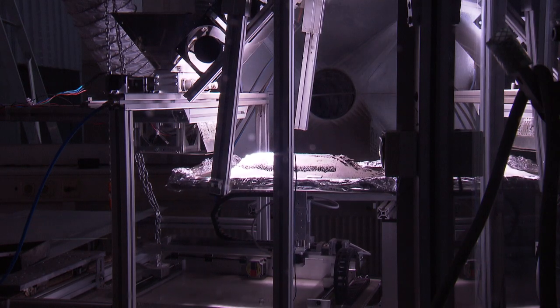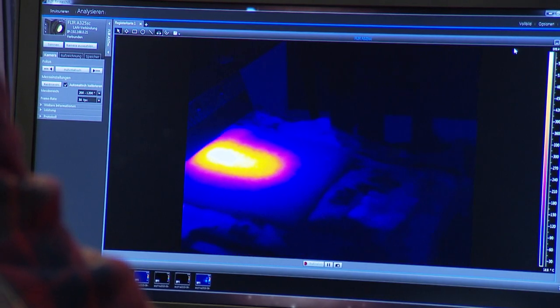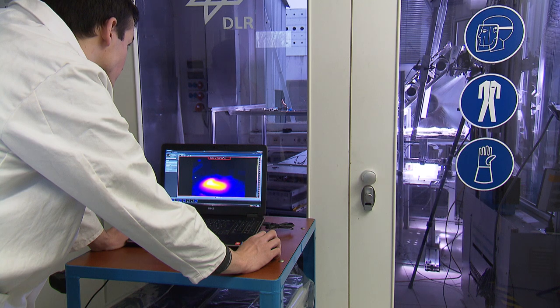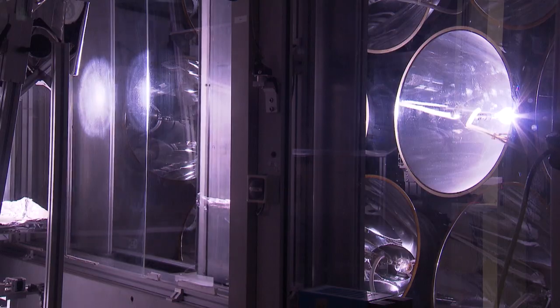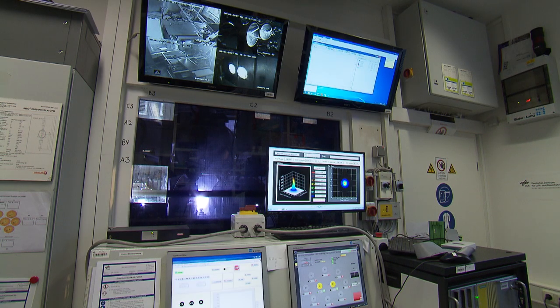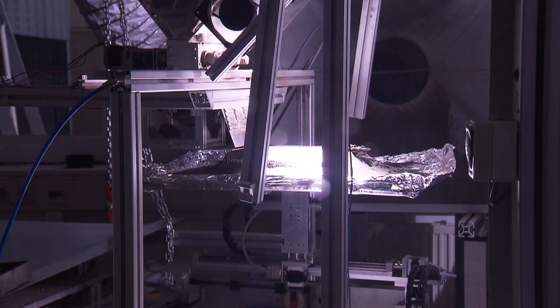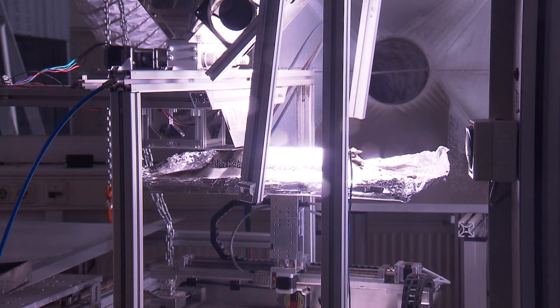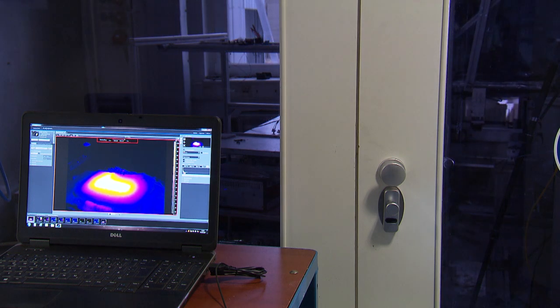The use of solar sintering in this unique research area was examined in three test assemblies, the so-called printing campaigns. The first is a system that works in ambient conditions in the solar furnace of DLR, doing 3D printing with an XYZ table. To simulate sunlight on the Moon, intense xenon lights are used. The setup is equipped with a shutter device — when the shutter is open, light falls onto the printer table and loose regolith is sintered and glued to the next layer of sand; by closing the shutter, the sintering process is stopped to allow distribution of a new layer.